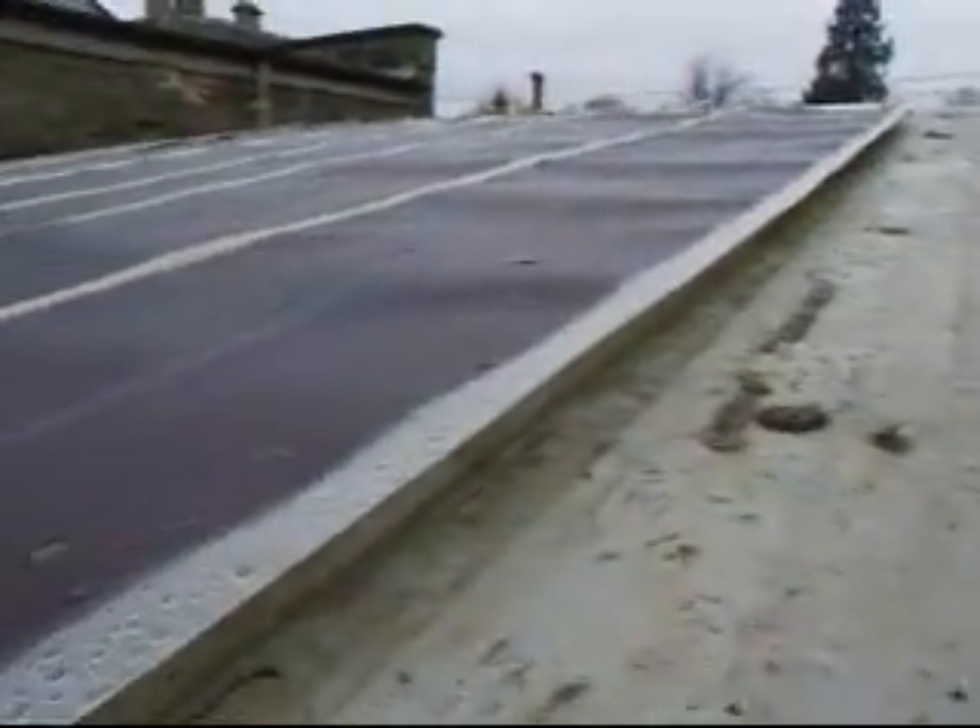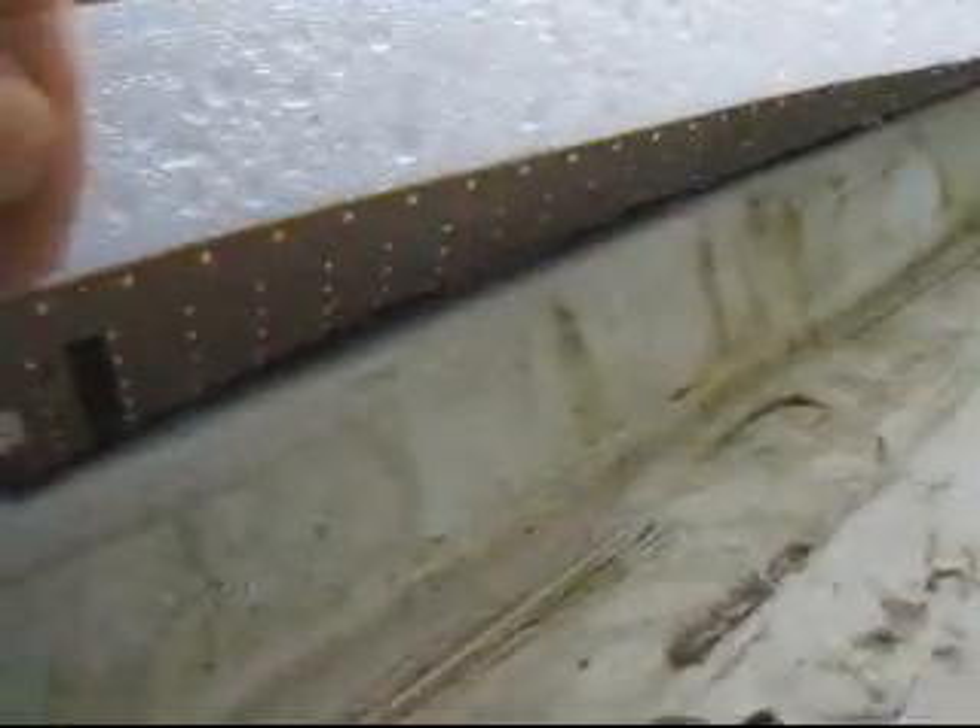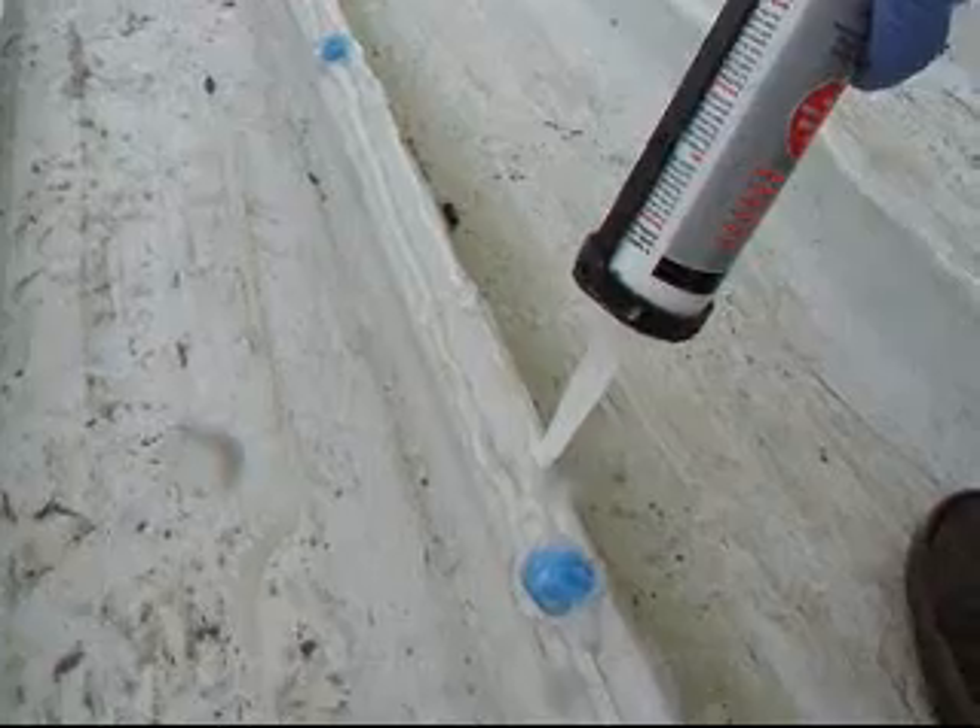It's rather difficult to see these lines of CT1 type glue on these ridges, but anywhere where there's a bit of metal we're putting a little plastic dot. It's a very easy thing to do, so we'll just roll it out. Here's the previous one - it's really stuck down very, very well. That's not going to move. We're leaving enough space here to walk between, to clear off leaves or whatever. And this is the application of the glue. This roof sheet is slightly bent at the top, so we're doing an extra layer just on the top ridge there.